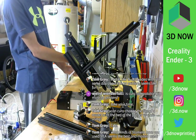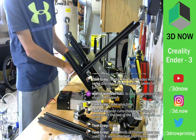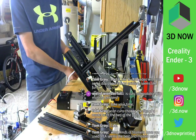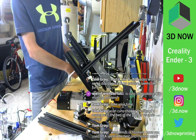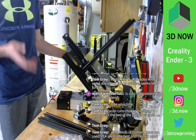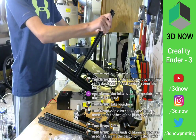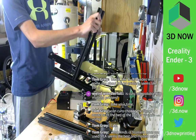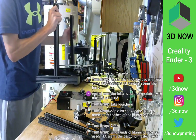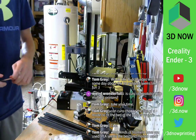But once you get more into 3D printing, you should probably try out some more exotics, which is fun. Like, I have wood, which is awesome. Most exotics are PLA composites, which means it's PLA plastic mixed with other materials. Wood is just PLA mixed with wood dust, but it prints and smells and sands like wood would. Also carbon fiber mixed with PLA, TPU, which is a totally different plastic, not PLA, but that's flexible. There's nylon. There's ABS, which is harder to print with, but it's a tougher plastic. Lego is made of ABS.